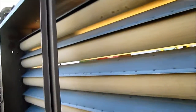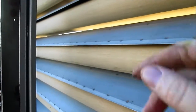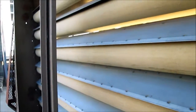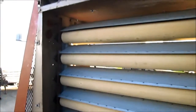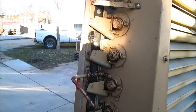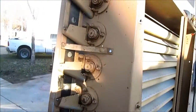Along here, these rolls turn opposite of each other and seed goes down the middle of them. Rough coated seed gets thrown out, smooth coated seed stays in and comes out the ends. They use them on clover, alfalfa, hairy vetch — anything that is slick from non-slick seeds.